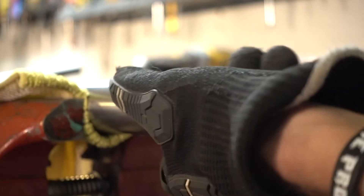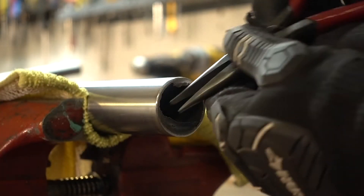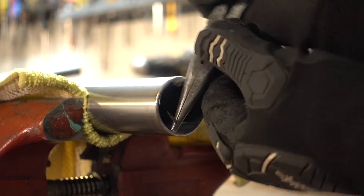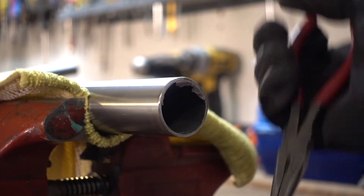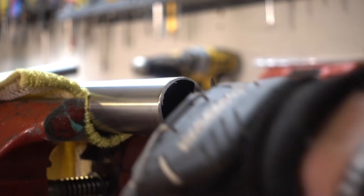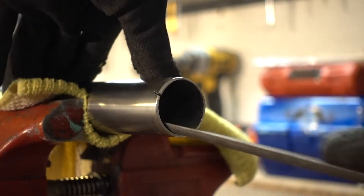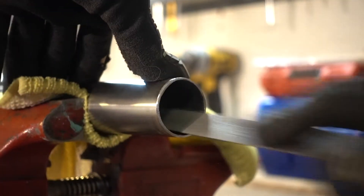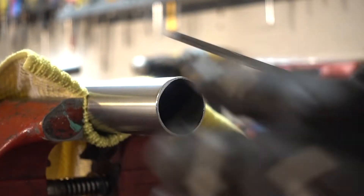Now that we got the burrs on the outside, let's worry about the burrs on the inside. We're going to take a good old pair of pliers and start getting these burrs out. If you guys have steel or aluminum bars, these interior burrs are not going to be a big issue — you don't really have to worry about removing them. Titanium is pretty special when it comes to cutting, so that's why we have to do this. Now we've got that all deburred, we'll take our hand file and go around the circles, then run the file around the outside one more time.